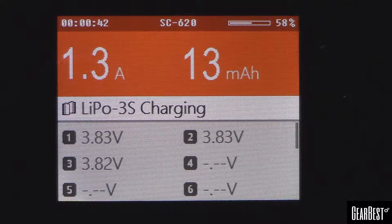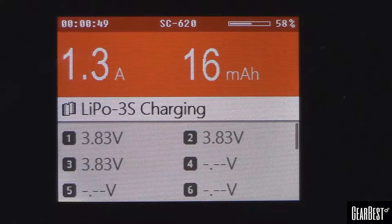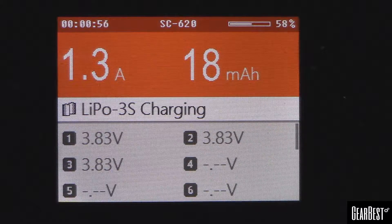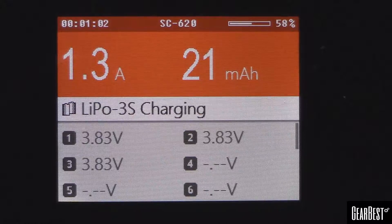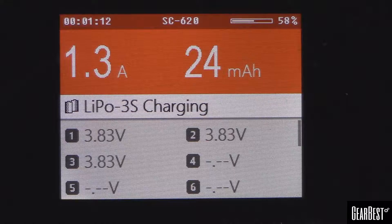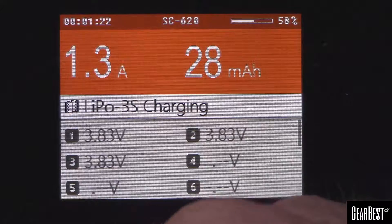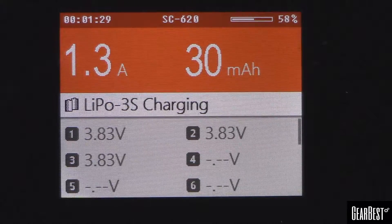I just thought this was so cool. The four-button chargers are great, they do a good job and show you the same information on a little screen, but this is just a lot nicer to look at and manipulate — you just have a dial and a button, no pressing and holding to start your cycle. One thing to note: this will do an auto-check every time you power it up. So if you leave the battery connected and then re-apply power on the input side, it's not going to start charging right away because it does a self-check.